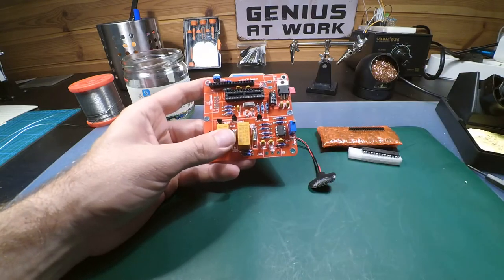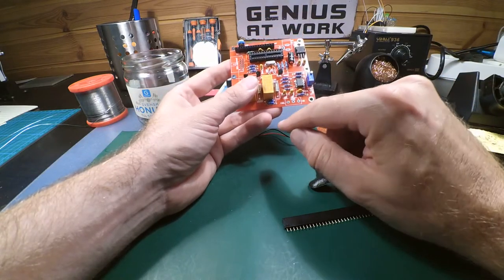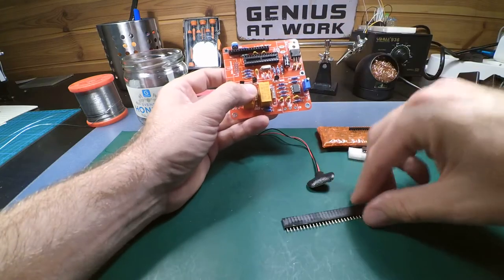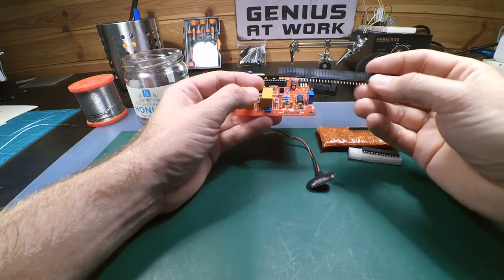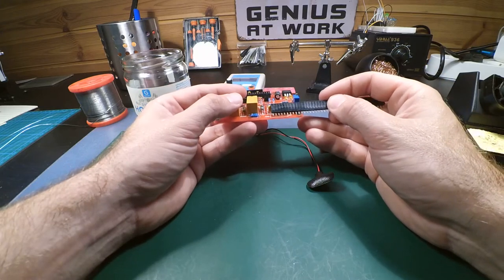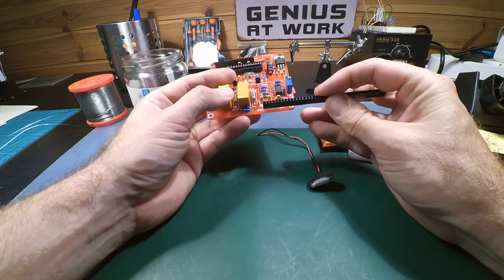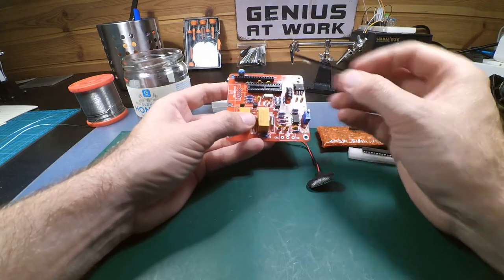Here are the connections for the components to test: capacitors, inductors, common in the middle, and electrolytic capacitors to the right. I have some standard pin headers — I'll cut off five, loosen two of the legs, and the three remaining will function as easy test points for components. Then we're going to power up and do initial power-up testing.